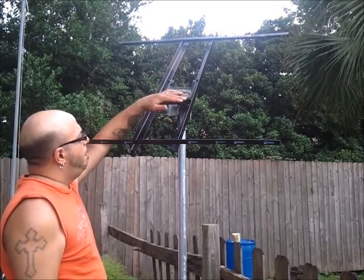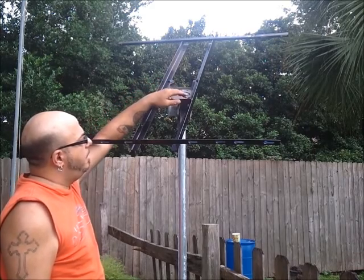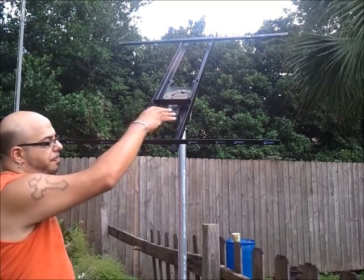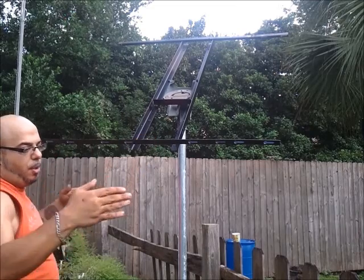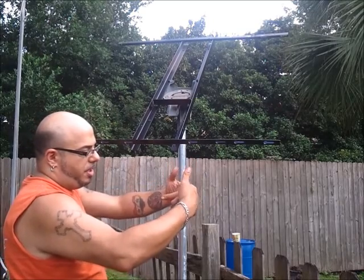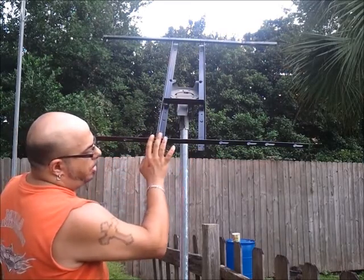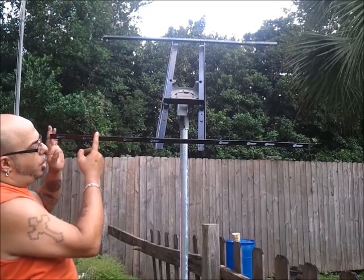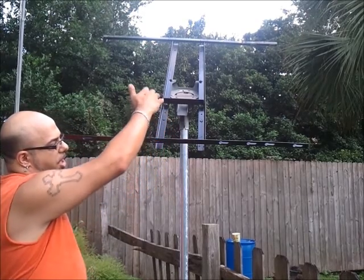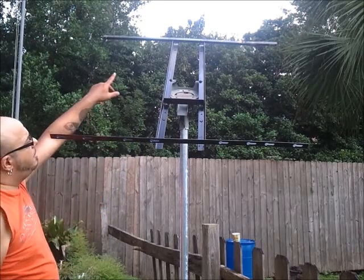After doing that, I tightened the two nuts up, put this piece right here — seven and a half inches long — tack welded it, drilled my holes through, and got the entire uprights fully mounted up. This crossbar joins them together under the bed to make the whole width. I had to add seven and a half inches longer to this piece, which I reused off another one. I kept the little holes at the bottom to help provide drainage, so any water that collects down the panel would drain out right here. I did the same for the top as well.